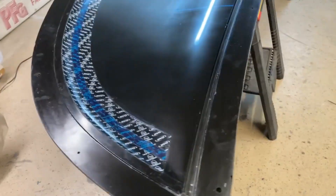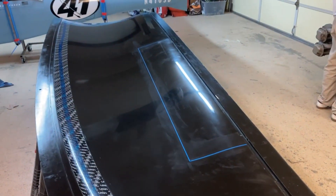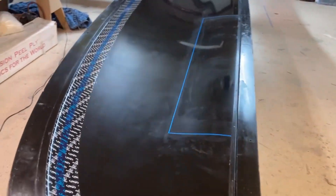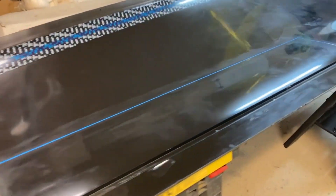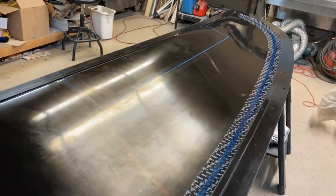Tape joggles are all in and we've got the aileron laid out. Now it's time to wax, and after we get it waxed up we can start laying cloth. I've got to get primer in first, and I'm actually out of primer, so that will have to wait until tomorrow. But we can at least get it all waxed up.